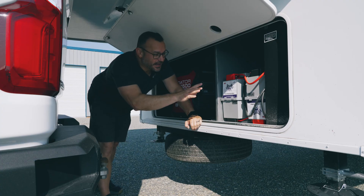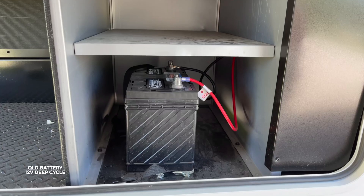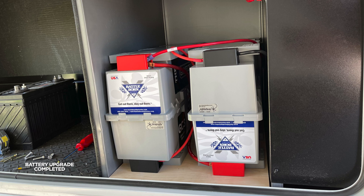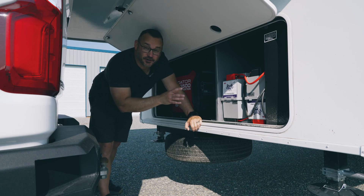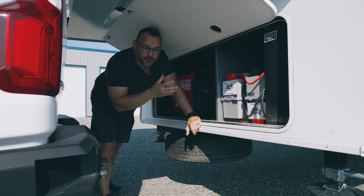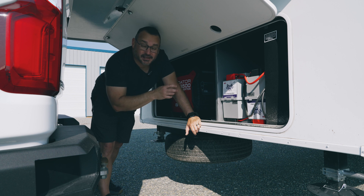Let's take a look at the battery bay. What I have here are two Battle Born GC3 batteries — they're quite large. I wanted capacity with this setup so we could be off grid and have a lot of available power. My goal is to eventually install an inverter to power AC devices such as blenders, microwaves, and stuff like that off these batteries. With the 800 watt solar combined with these batteries, I felt confident we could utilize a lot of electricity overnight and still have enough power to get through the full evening if we needed to run the heater.